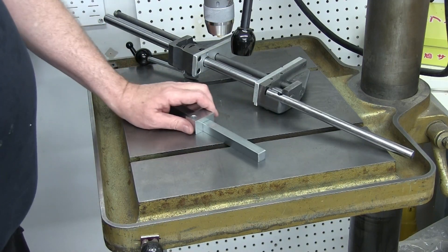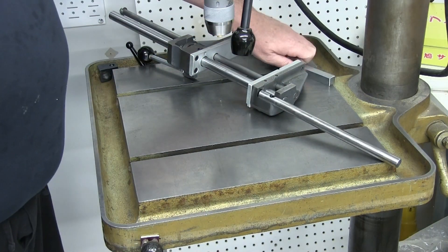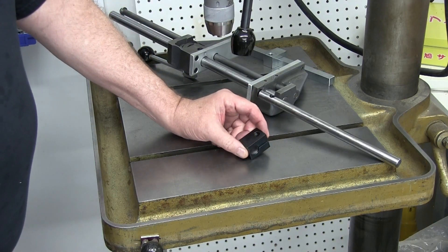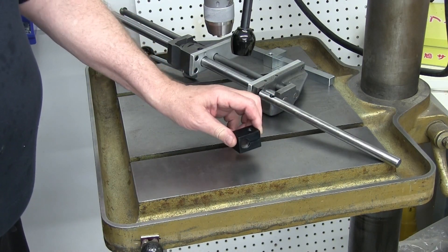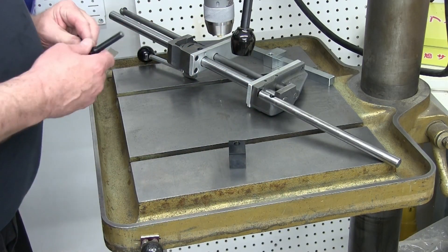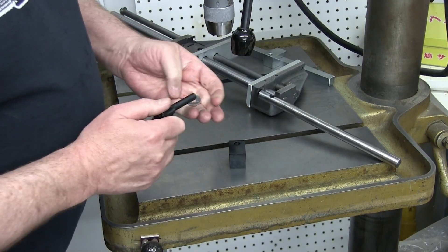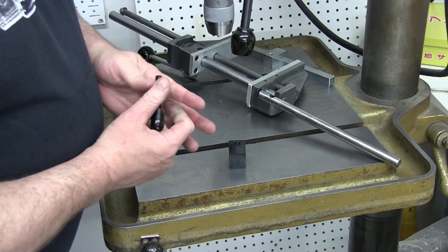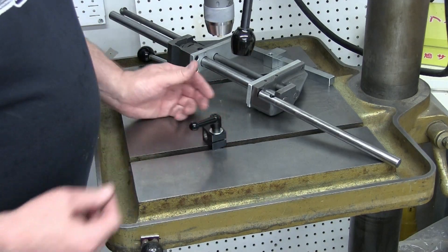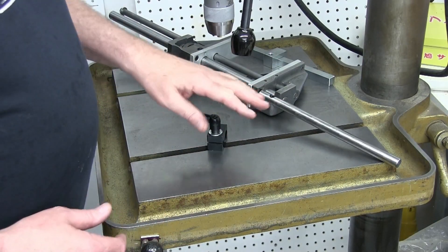So I decided to do a round bar and a split clamp for it. This will tighten down with a releasable adjustable handle and a washer. You can just put this on there — it's got a T-nut that goes in there, tighten it up, it doesn't move, and it slides really well.